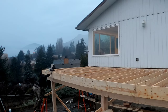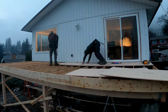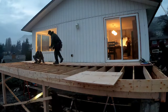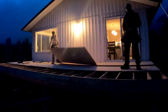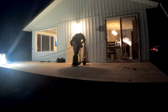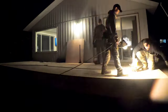And for my favorite part — sheeting the deck. Make a mark at four feet on each end of the deck, snap a line, and that'll be your guide for your first row. It's very important to get that first row perfect — that way the rest of the sheeting goes very smoothly. Use a good subfloor adhesive for each joist. I like to start my sheets full sheet first and then split it halfway in between on the next row so that you have staggered joints. I like to use two-inch nails and we nail them every six inches on center. And once we get it nailed off, I go around and trim any areas of the sheeting that need to be trimmed.